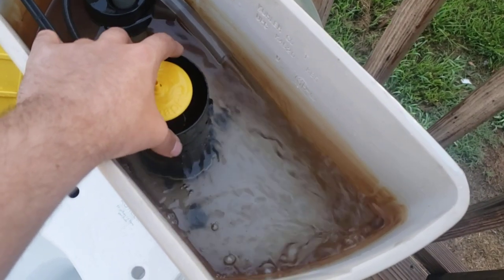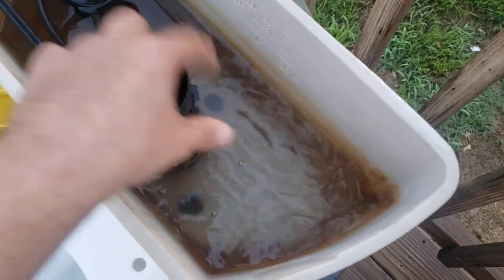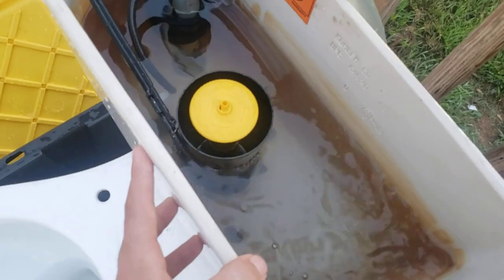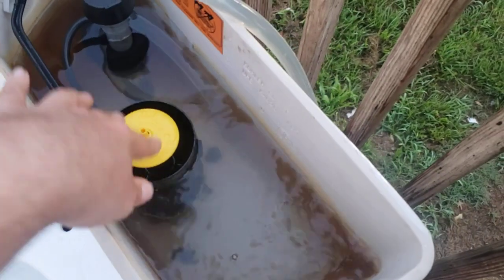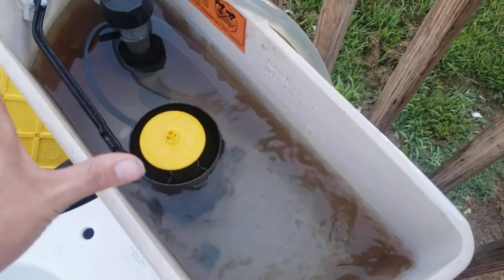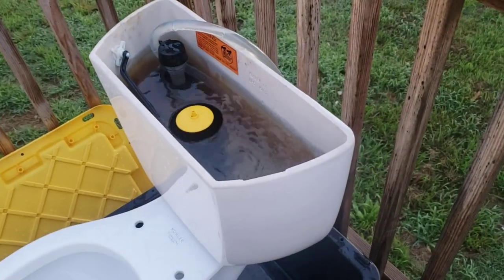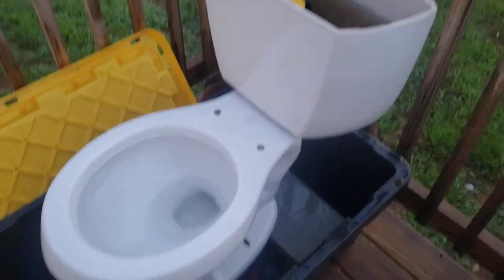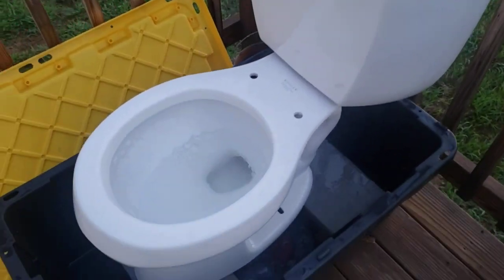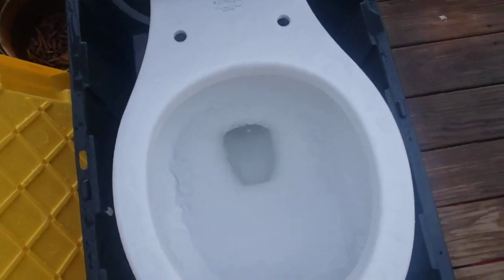The final point of this video: if you have one of those with the extra-large seat in the bottom with a metal bracket in there where you can't put a normal flush valve in it, get one of these — it'll probably help you out a little bit if you're looking for a longer flush. It won't be quite as long as if you were to get a flapper in there and adjust it to the max water flow, but it will help and will at least let you get a little more usability out of your Class Five without having to hold the handle down. I didn't really know there was a difference in the aqua pistons, but there actually is — anyway, here goes the final flush.